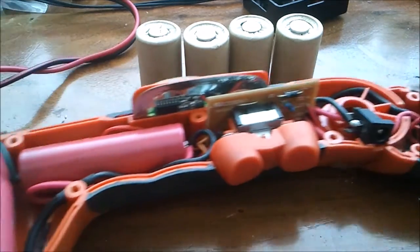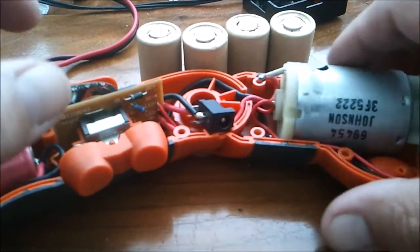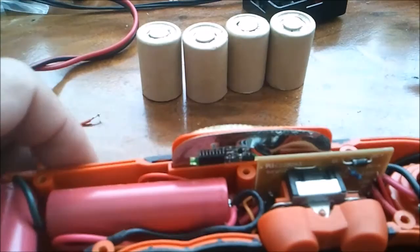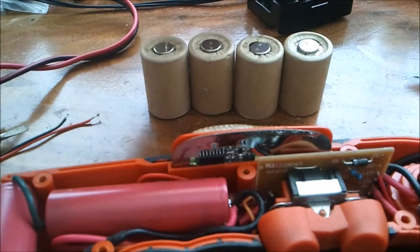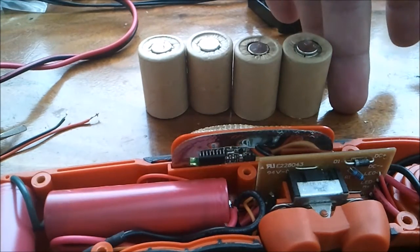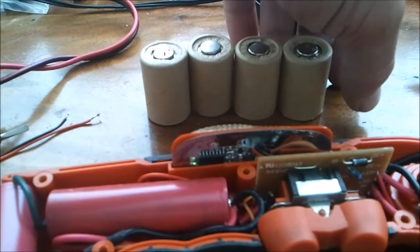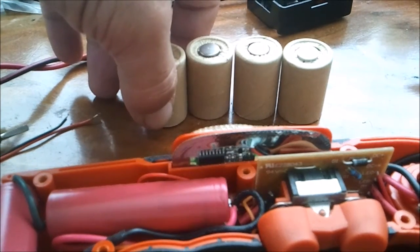These have 35A, a lot better to run this drill than the laptop batteries, and I have already had this together and tested it out — it works great. This originally came with five 1.5 volt C cell nickel cadmium batteries, the old style. There were five of them but it had one dead cell, so it would charge up and show full voltage off the four good cells, but whenever you hit the trigger it didn't have all five cells pushing enough power to run.